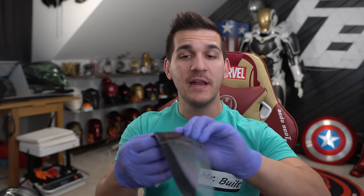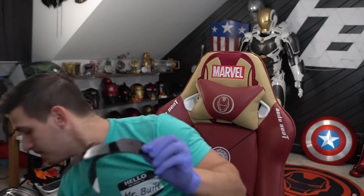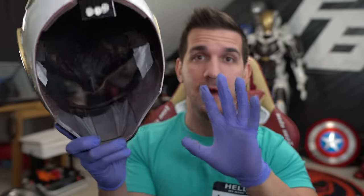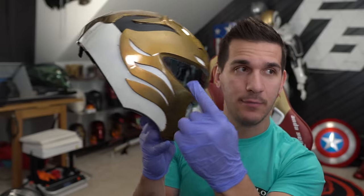After riding the struggle bus a little bit I think I got it. It's a little dirty and I still need to work some bubbles out of the tint, but I'm really happy with it. I took my time using the template and a lot of fitting trial and error. What's great about PETG is I was able to take a heat gun, heat it up and let it droop and bend over my leg to hold that curved shape — because if it's flat it's going to want to pop out of the helmet. At the very ends I'm going to use a little bit of Velcro — not in my line of sight — so if I ever want to make the visor darker or lighter I can pop it out, just like I do with my Mandalorian helmets.